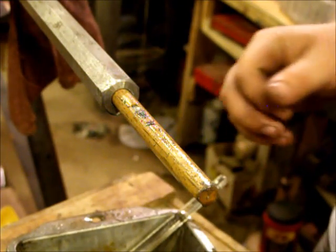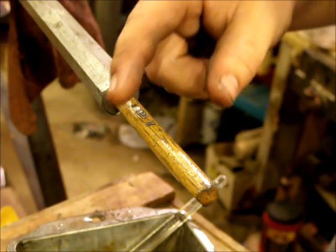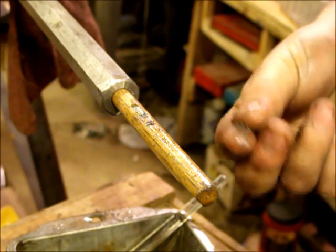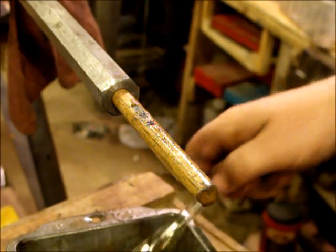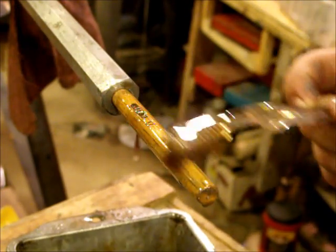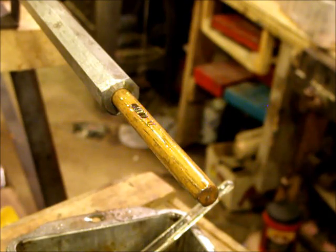Here is the cutter. This is after the last pull. This is how many chips were there. It's a good amount. A couple more passes and I'll have to raise it up. During use, you just throw a little oil on there and clean the chips off. Once it quits cutting, I put a shim underneath the cutter.